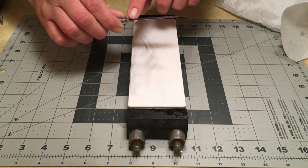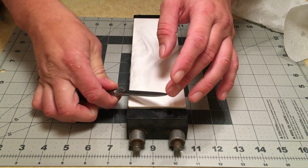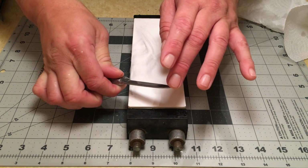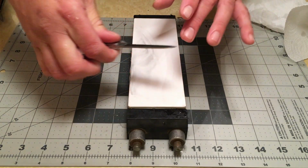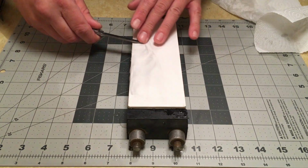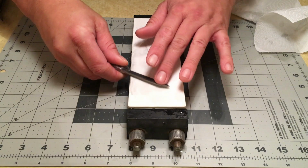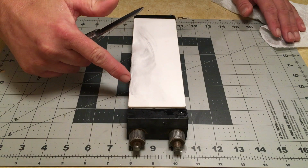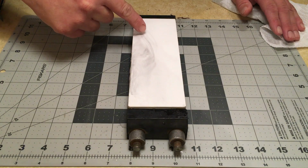To get down in this base, what I'm having to do is angle the knife kind of like a U in this fashion right here. And then as I draw through, I'm putting my pressure like this. So I'm doing a U kind of shape. That's allowing me to get all the way at the very base where that plunge is, where that sharpening notch is, all the way to the tip. And you can see on my stone, I'm grinding right along the base right in here, I start to transition to the middle, and then we start hitting up in the belly and tip.